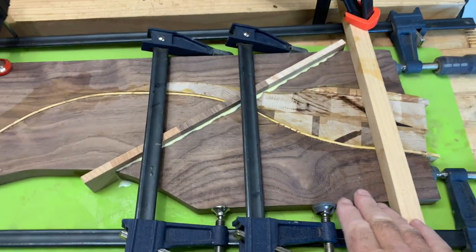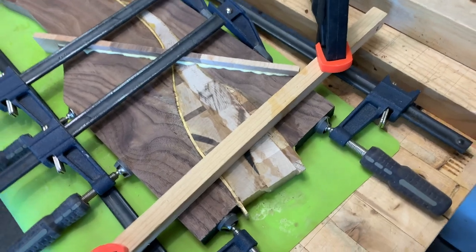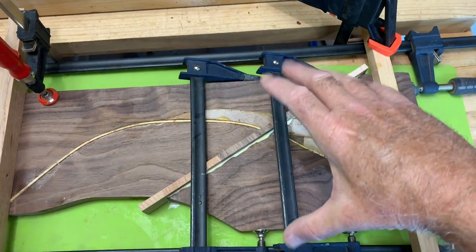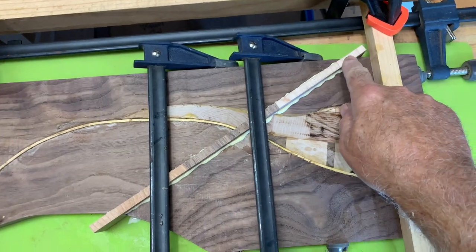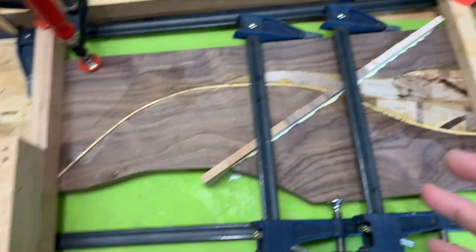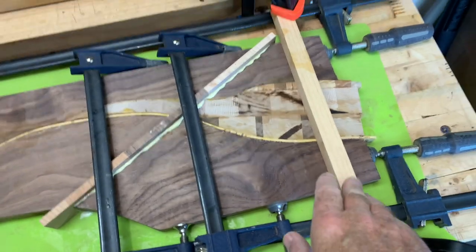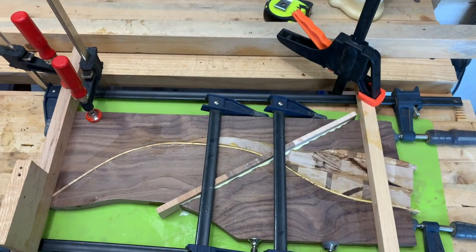I'm gluing in this straight multicolored piece — it's got maple, walnut, and cherry in it. The key to this glue-up is to make as many complicated clamping pressures as you can get. These two long clamps hold the piece from sliding when you put the shorter clamps on, because when those squeeze, the top board would shift and be mismatched. These two clamps prevent it from getting longer, and then these two are the ones that put the pressure to hold it together. Then we have cauls on here in an attempt to keep it flat. I'll let that dry and see how it looks.